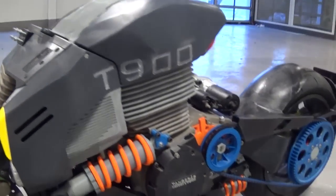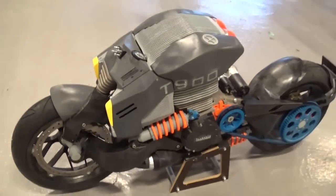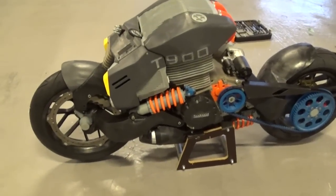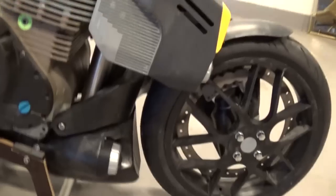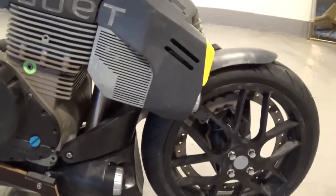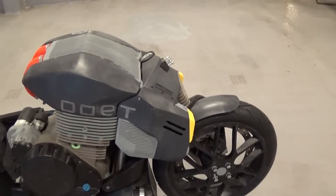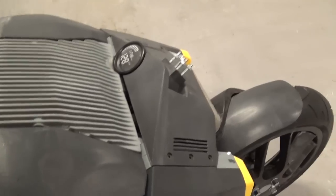Most of the machine is made according to the equipment I have in my shop. You won't see any bent tubing because I don't have a tube bender. The only tubing on this machine is the exhaust pipes, and they are straight. Otherwise, most of the things you see here will be milled from aluminium blocks, like the tank. This part here will be milled from a block, and the backside also, and then I will weld it together.